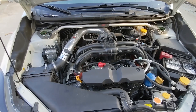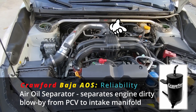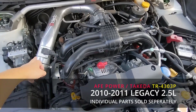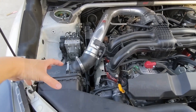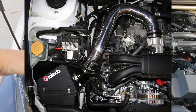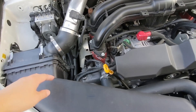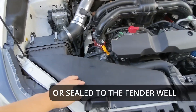One of the reasons why I chose this particular intake setup was because of ease of maintenance. Most aftermarket cold air intakes utilize a cone-type filter. When I bought this Takeda kit — which was meant for the 2.5 Legacy and Outback — it came with a metal box. It wasn't completely sealed, had high vibration issues, and it had a big cone filter. The box wasn't sealed up so you get engine air leakage into there. It's really important if you want a cold intake charge that this area is sealed right to the front of the radiator.